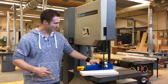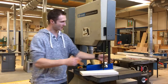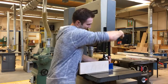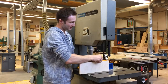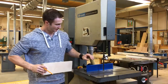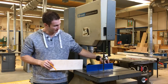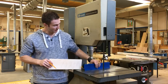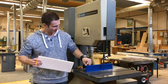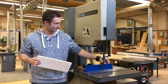As far as setup goes on this bandsaw — this is our re-saw bandsaw. First of all, all the safety rules apply. Our guard height — we're going to maintain that kind of pencil-width guard height. This is a new fence that we have for this machine. It's a magnetic fence and it just uses these little twist locks on the side here. You can move this thing anywhere you want. Just turn them to lock it down and it's actually a very tight fence that works really well.